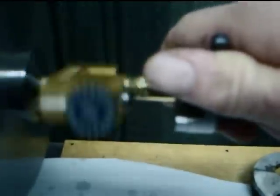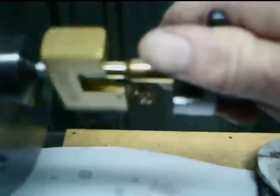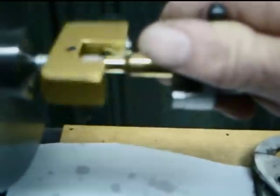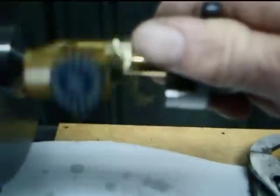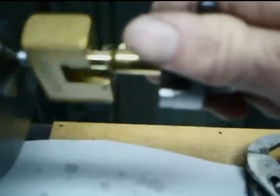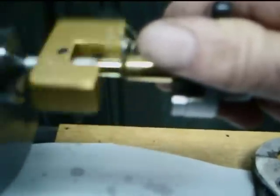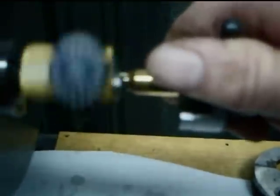The mandrel's got a stop cut into it. We're using a 5/16 inch mandrel that's been turned down to about 0.305. We'll go up to the shoulder very slowly, then pull it back out and let it cut just a trace as we come off.